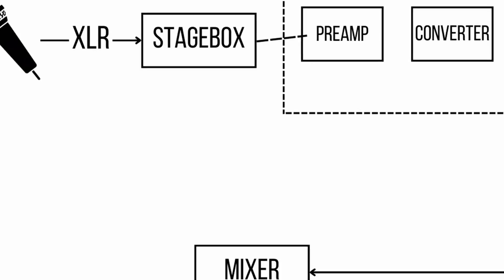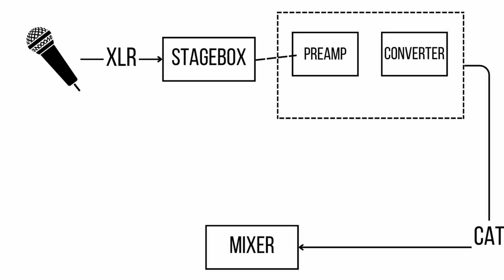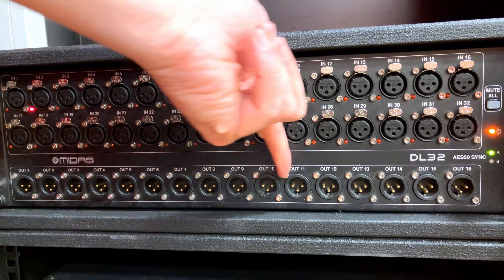It's not just the outside that looks different — the inside functions differently as well. When you plug into a digital stagebox, you're actually plugging into the microphone preamp, and then you gain up your microphone. The microphone signal stays at the stagebox and is sent to a digital converter, where we change the analog signal to a digital signal. We then send it along the Cat cable or fiber cable straight into the mixer — already a digital signal, ready to be processed. The return channels are also sent back as digital audio and converted from digital to analog at the stagebox.